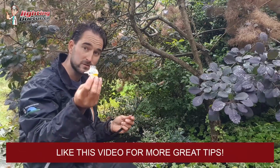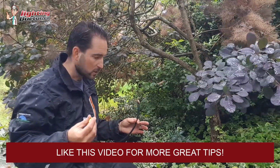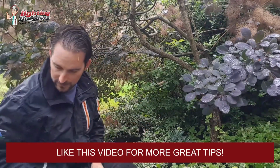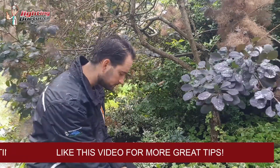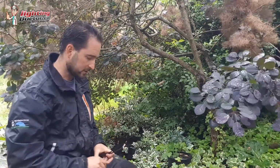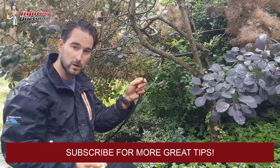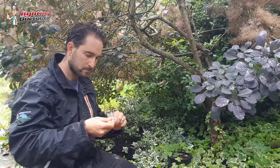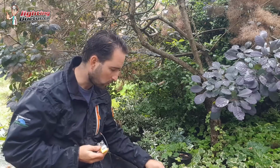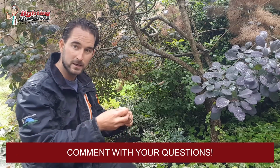So what most people do is they just end up using one connector and putting all the wires in, and then it shorts everything. But that's not how you do it. Even on this last fixture, you still need 2 of your connectors. So you're going to have your 12-2 wire, and you're going to split that, and you're going to take one of those wires and throw it in the big port on your BVS2 connectors, and then you're going to take one wire from your actual fixture and put it in one of the small ports on that same connector.